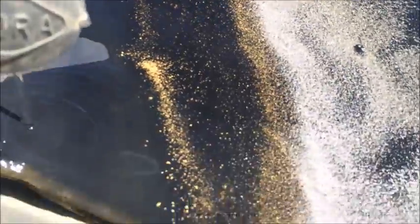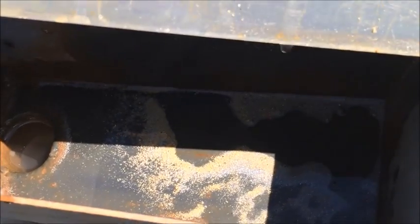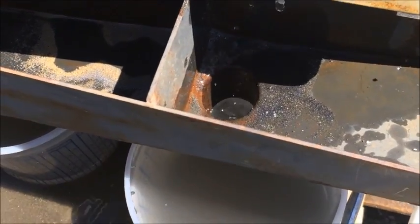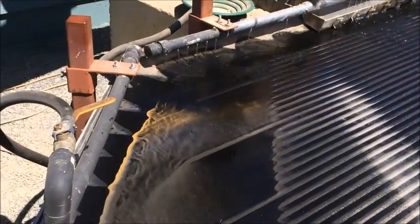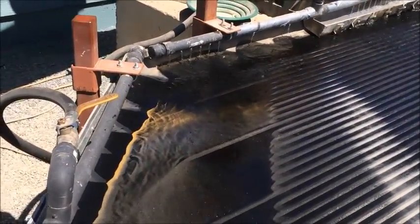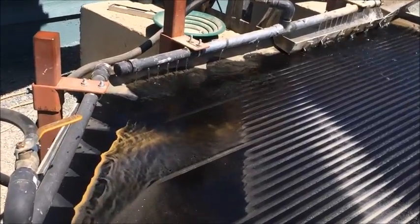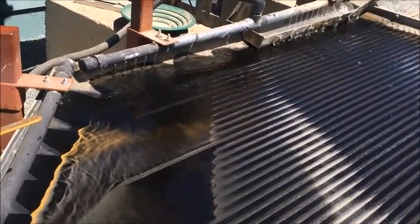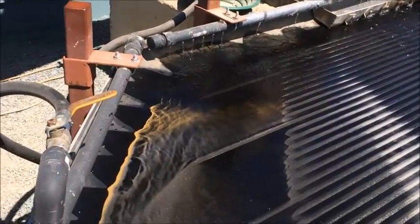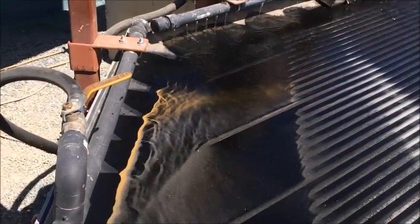It just makes a real nice line of gold right down under the water bars and into the trough — number one and number two, high grade cuts. Now when we're done running a couple two or three hundred pounds, we've got to brush down the table because the gold hangs in the grooves. So we brush it down and this is really where we get our strong, strong line of gold.